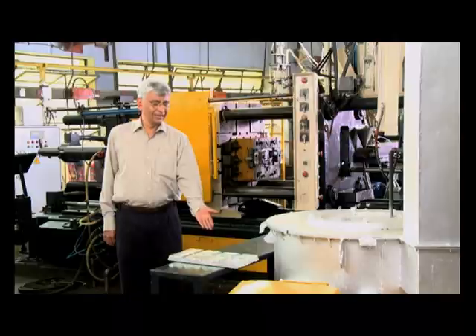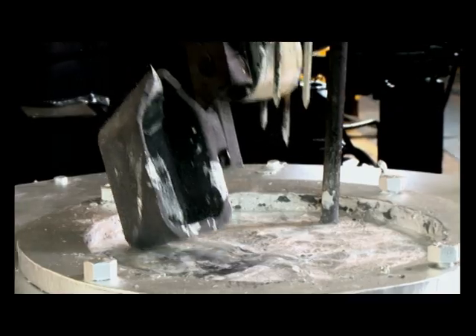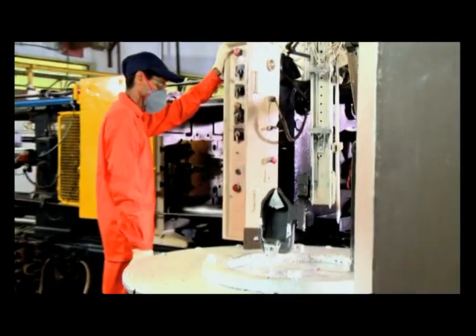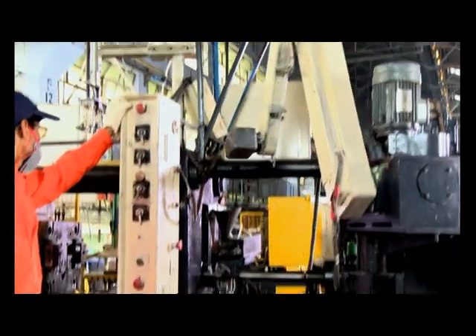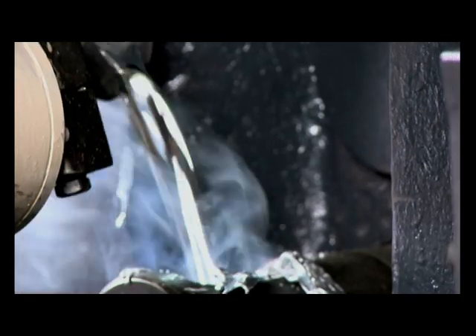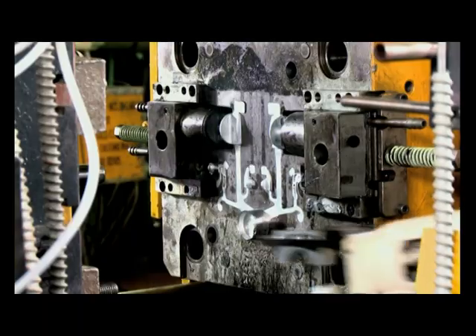These mazac ingots are smelted to 450 degrees centigrade and injected into the die to form knobs for the Tri-bolt latch. By innovatively automating this process and using a 250-ton die casting machine, Godrej has increased efficiency by 67% and more importantly improved quality and operator safety.